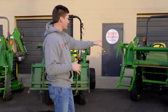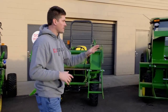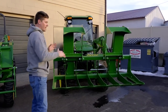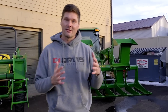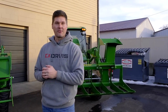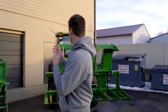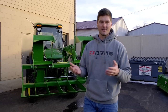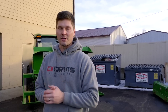Another version of the brush crusher is about 250 pounds, and then my double claw WorkSaver grapple — six feet wide on the 4066 — is around 550 pounds. You want to size these appropriately. Say you have a loader on a little 1025R that only lifts maybe 800 pounds max. If you put a 400- or 500-pound grapple on that, you're only going to lift a couple piles of little twigs. Size these things accordingly — that's why it's important for me to know what you have upfront.